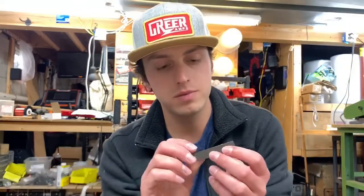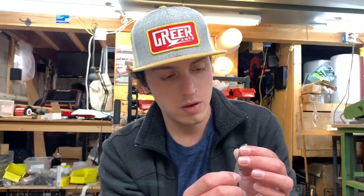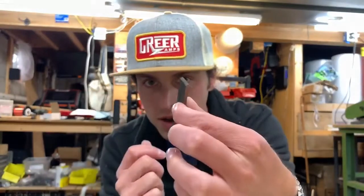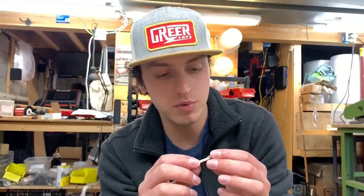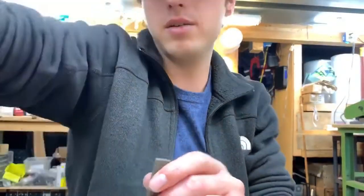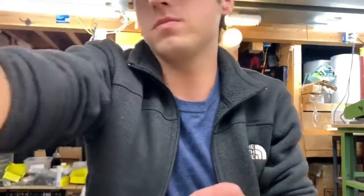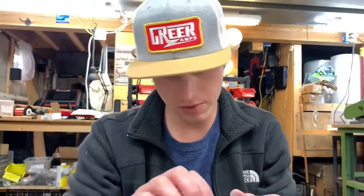Looking a little closer, I see a magnet. That looks like an original magnet — and it is. You can see this one actually has a cool little notch cut out of it. I've actually seen that before; I have another one that looks just like this. I believe this is a short magnet. Yep — this is an original short Alnico 5, probably from the early 60s.